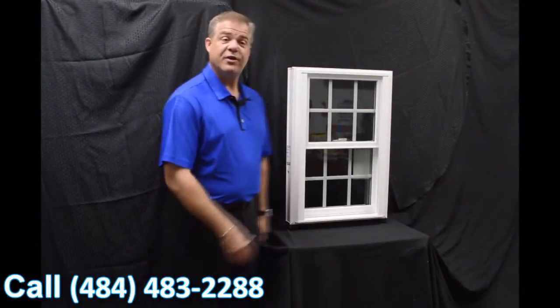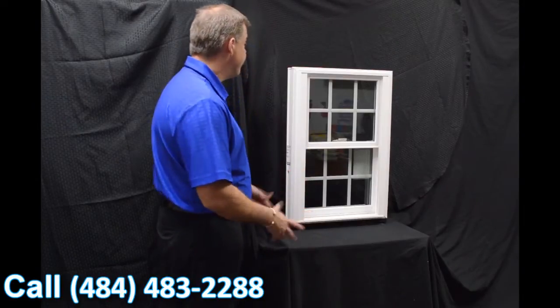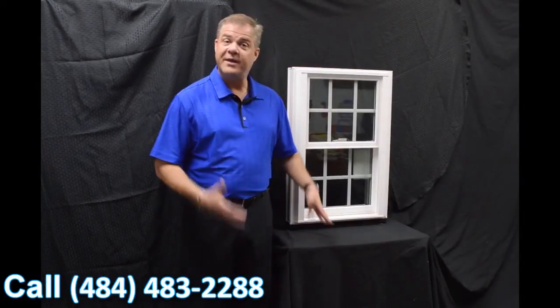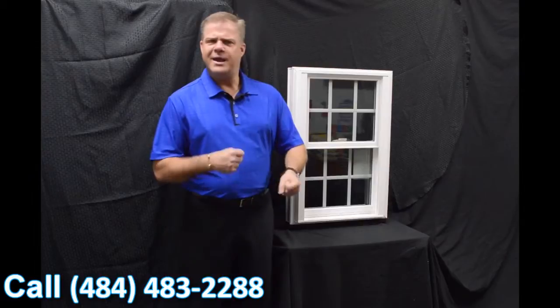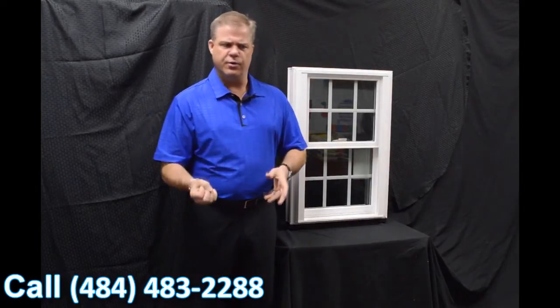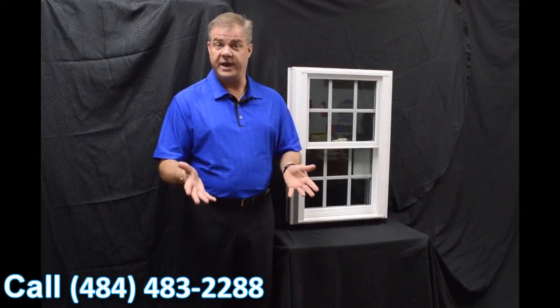As we get into the exterior of this window, a couple of things that I wanted to quickly point out is the fact that this window is fully fusion welded, both mainframe and sash. The great thing about that is there's no mechanical parts or pieces that are going to loosen where water or air is going to get inside it. So it really provides for maximum weather protection.